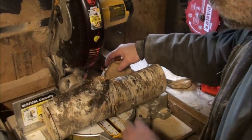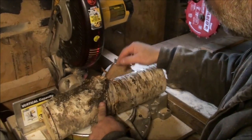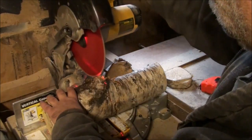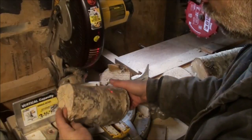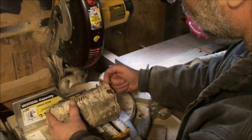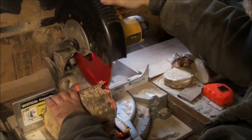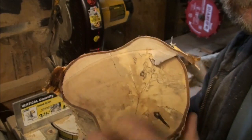I've got a piece of wood here that I put on the backside to bring this out so I can square up the curve and cut on the backside of the wood. This is up against the fence and down against the table. There's a little knob on the bottom side where a limb used to be. So if I want to cut the backside, I can prop that up close to square and put a piece on the backside to shim it out. That'll get me close enough to where I can sand the rest down on the belt sander.